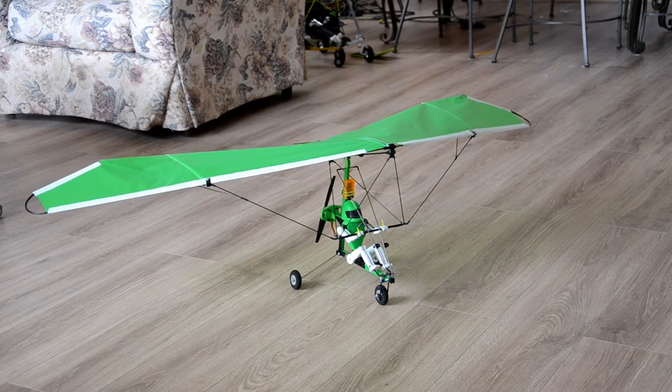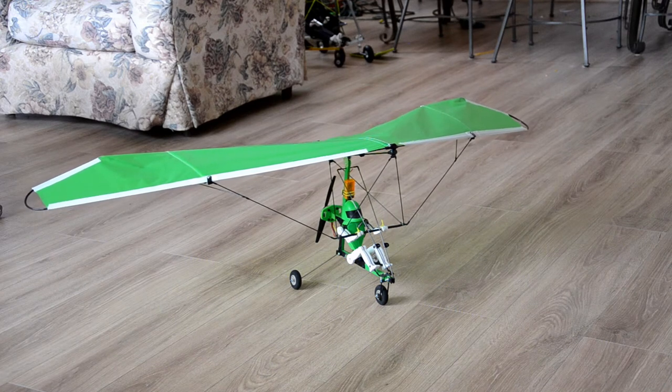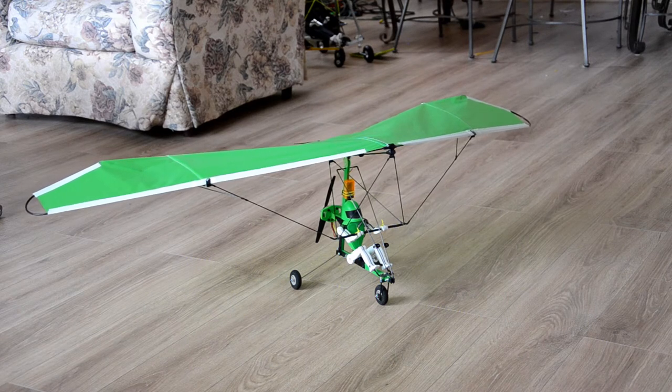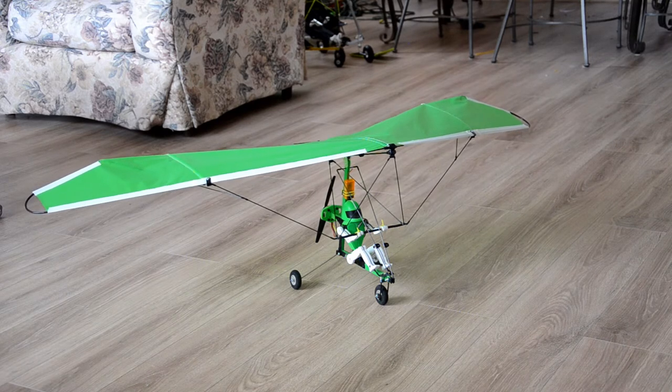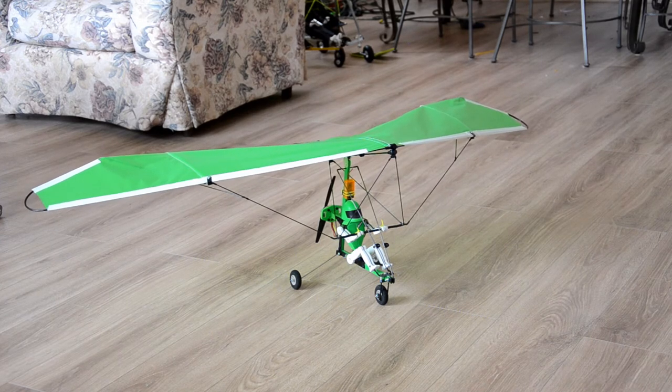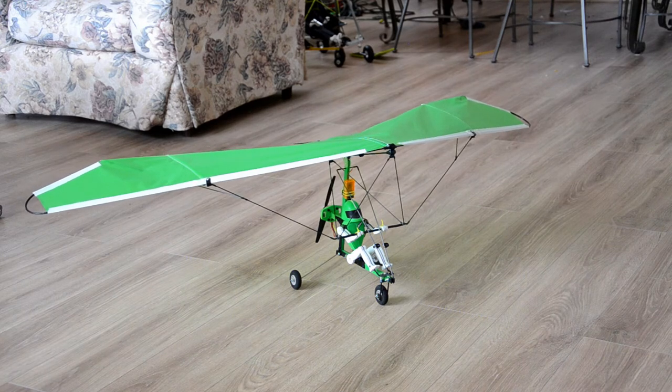It's also got a center rib pocket, which is also sewn. The original model had two additional ribs that were part of the wing. And so we've done away with those two ribs because this particular wing does not need them. At this weight, for this particular product, it does not need the ribs except one single rib at the center to give you the curvature and the airfoil, and the rest is done via the washout rods that give the model the particular shape that you see in this video. So we've done away with many of the little parts for the structure of the wing, simplified that, made it a lot cleaner, sewn the wing, and now you have a very nice clean wing as you see it in this model here.